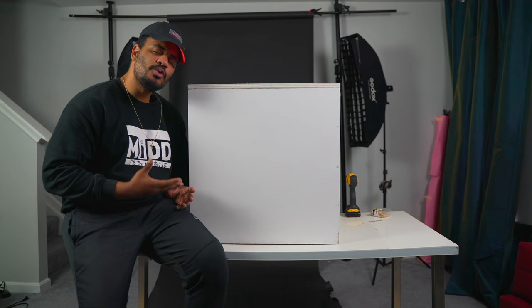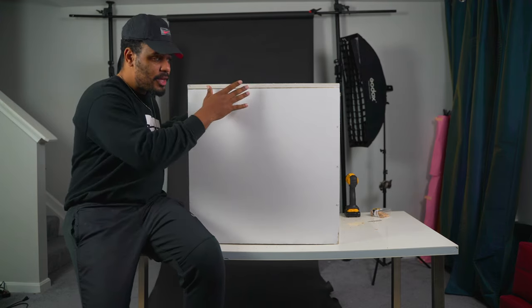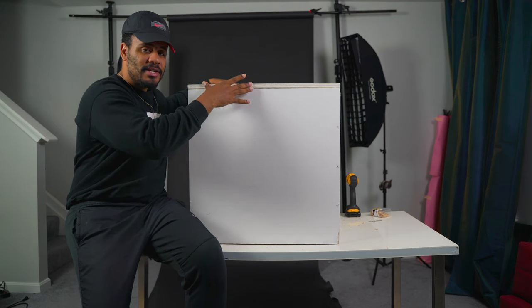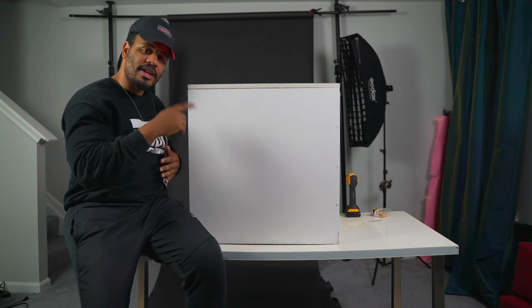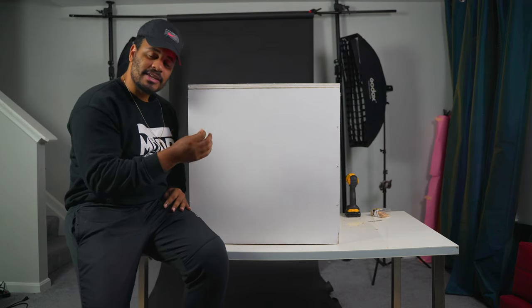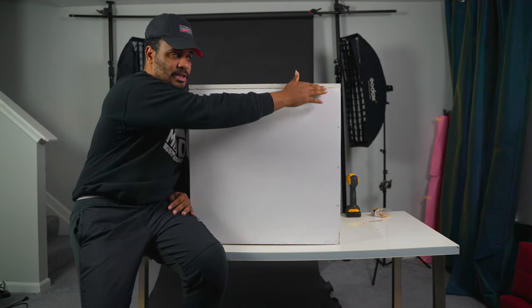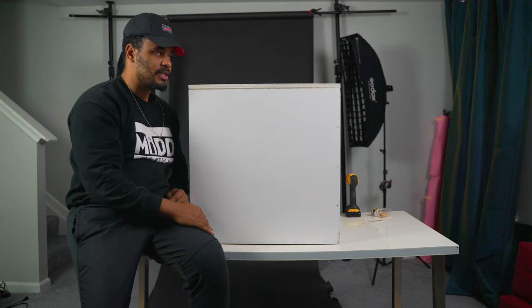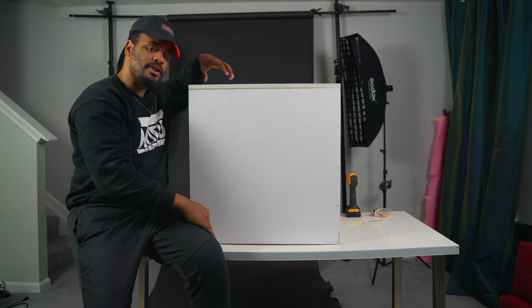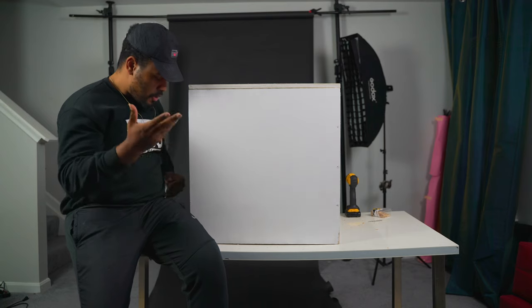I just want to give you a few lessons learned, that way you can take it and implement it when you do this. Now, the first thing is that I already explained that if you don't want the look of this top piece, you actually want this top piece to sit inside the frame so that you don't see this piece right here. I explained that earlier in the video. Another way you could get around that is getting something called plastic wood, and then you can fill in these spaces, and then you will have to paint over it again. But I would probably go with the previous suggestion, which is building added support inside and then cutting this piece smaller so that it sits inside the frame. So that is the first thing.